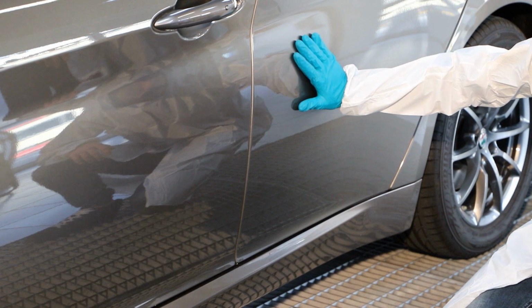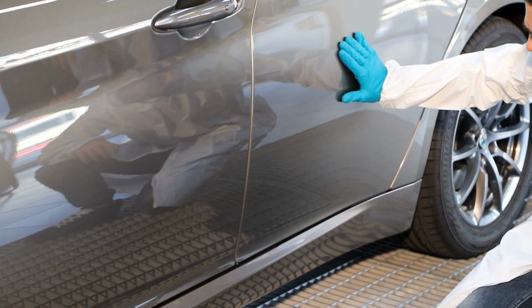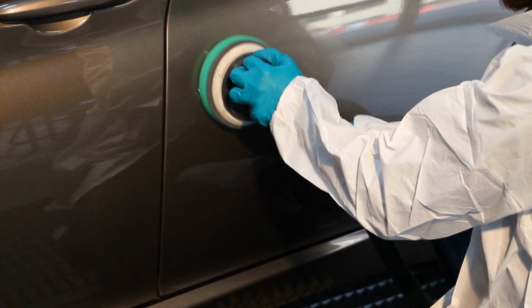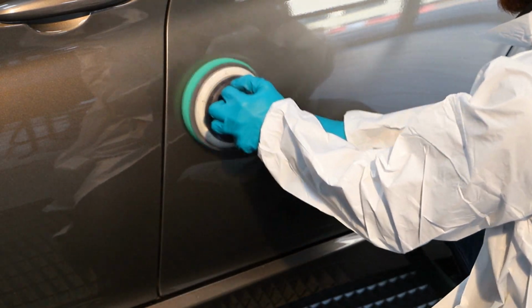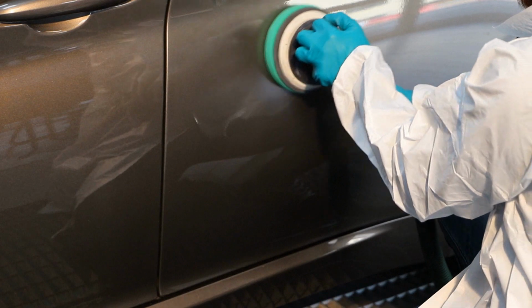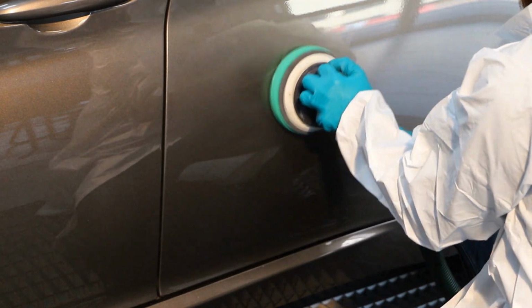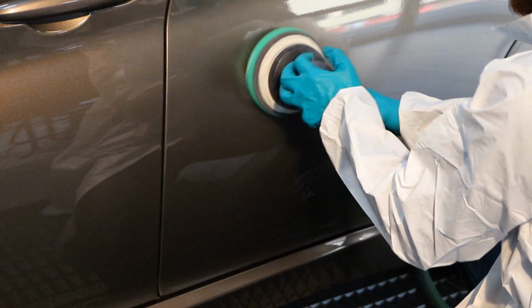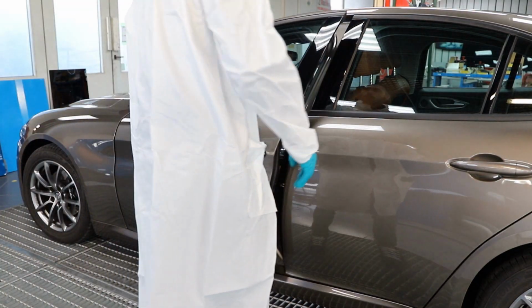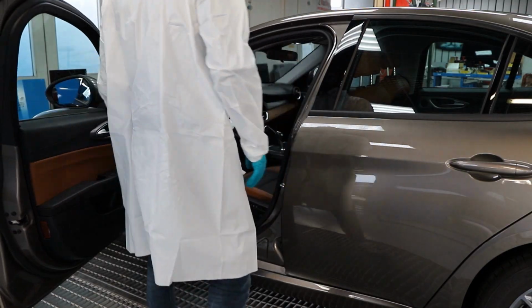Identify a spot near the damaged area, free of scratches and possibly flat. Carefully clean the area with the help of a car polisher and gloss restorer. This will result in a more accurate measurement with the correct level of gloss, avoiding the reading of any dust particles. Before taking measurements with RapidMatchGO, locate and write down the colour code of the vehicle. This will be helpful later when using Paint Manager XI to identify the right colour variant.